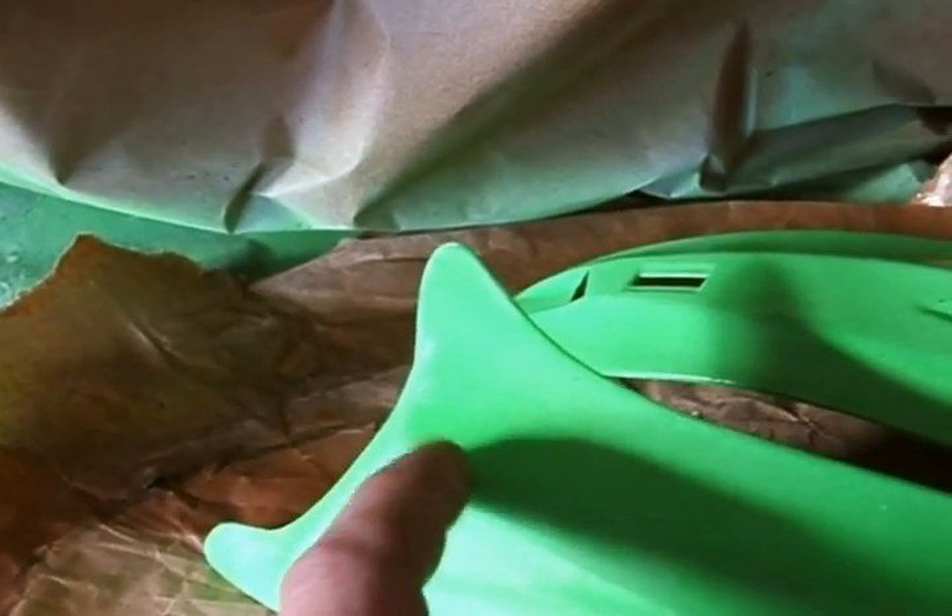You can't cut corners — you've got to be very patient. Also be very careful when sanding the high spots because it's very easy to expose the work underneath. You don't want to end up with bald patches after all that painting. So be ever so careful on the corners — make sure you get the flat areas and just slightly go over the corners to take off the high spots there.